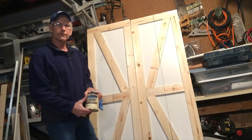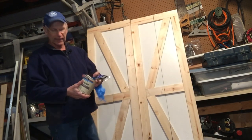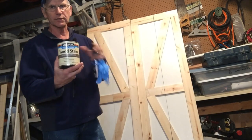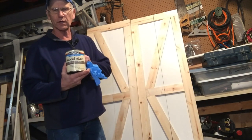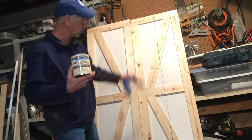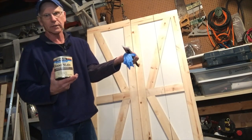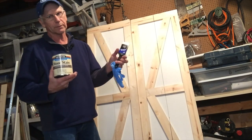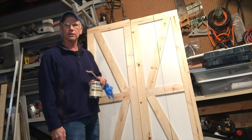Now that we've got our doors built, everything looks great — this is going to look sweet. I like to use a water-based stain. These doors were already pre-painted, so a water-based or latex stain will actually cover better. It's really easy to control the grain and the color throughout the whole thing. I'll wear some gloves and use a cheap throwaway brush. Let's get some stain on these doors and see how good they look.